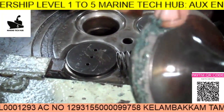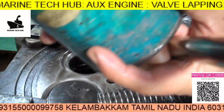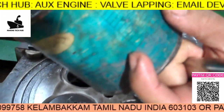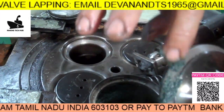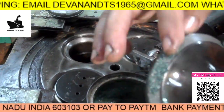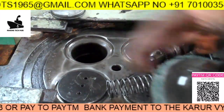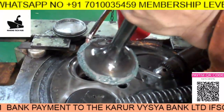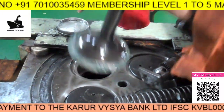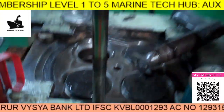or normally we say lapping — once we start lapping it, you have the special spring here. This is a medium rough grade. So apply the grinding paste all over and also apply oil so that you can lap it properly. You have a special spring here.